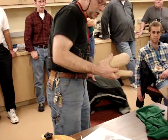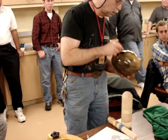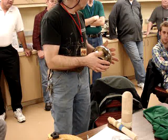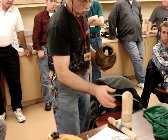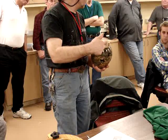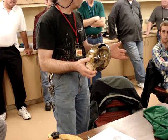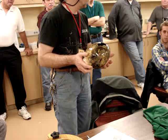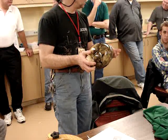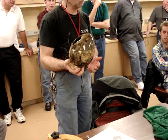These are some of my jam chucks for when I'm doing hollow forms. Most jam chucks just cover the rim of the vessel, but a lot of my vessels have large holes on the sides. If you put a jam chuck up here and bring your tailstock up to the bottom, you're going to crush the piece. So I have a few of these — this goes inside the vessel. They're undersized and I just wrap masking tape around it until I get a snug fit. This way I've got support in the bottom of the vessel to do my bottom work — put a bottom on it or take the bottom completely off. With the tape on there I took this completely down to nothing with no problem — the vessel didn't fly off.